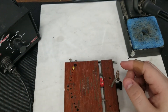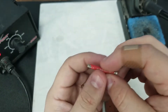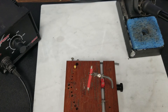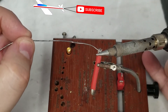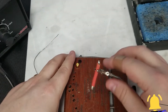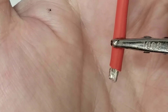We have some wire already pre-stripped — notice how little is stripped off, only about an eighth of an inch. If you overdo the length trimmed, you'll have to do more heat shrink to seal it up. We'll clamp this in the jig. We'll grab our soldering iron that is already hot, place it on the wire, and feed the solder underneath the iron so it begins to liquefy into the wire. Once done, you'll see a pretty good shine on that solder — you're always looking for that high shine.